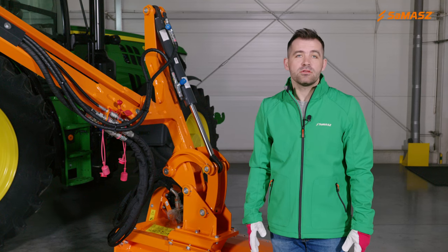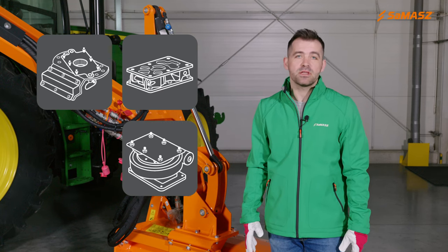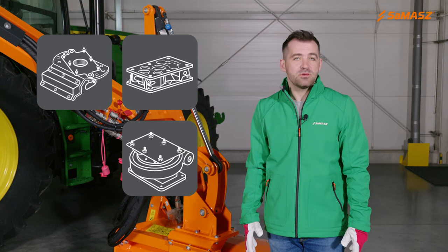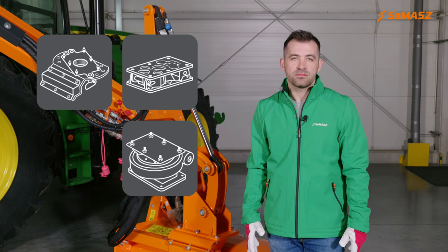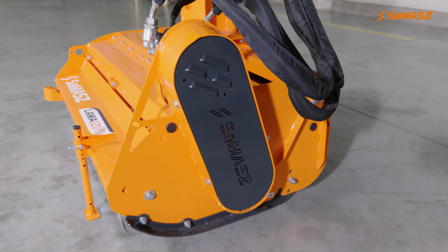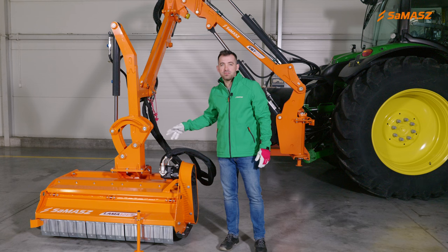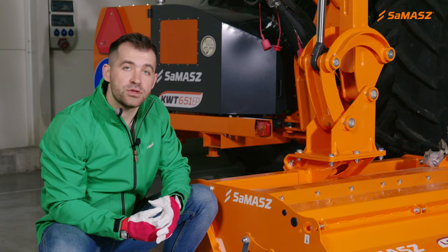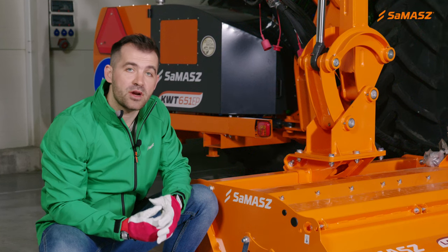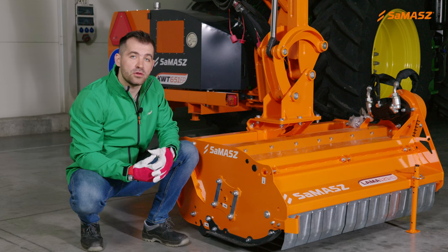Samasz optionally offers several coupling mounts, like the mechanical quick coupler, the mechanical swivel adapter, and the hydraulic swivel adapter. If you choose the hydraulic swivel adapter, you can't cut while driving the tractor backwards, because the overrun protection will not engage and you may damage the entire arm. The flail shaft is run by a belt drive, which is driven by a hydraulic motor powered by the arm hydraulics. It is always worth paying attention to flail shaft vibrations — if vibrations occur, the most common cause is a missing flail. While changing worn or missing flails, always remember to do it in pairs with flails on opposite sides. That way you will keep the rotor balanced.